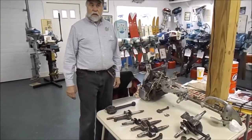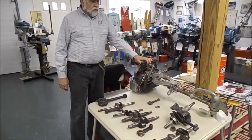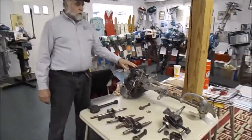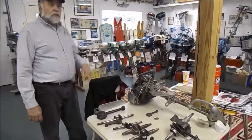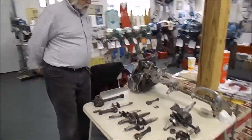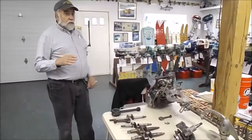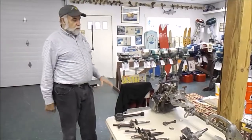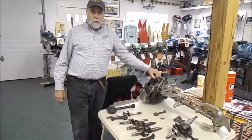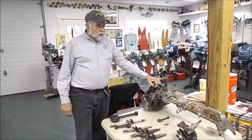The ELTO was an early example of an outboard with a case hardened crankshaft. The Johnson breakthrough really came with the Johnson motor wheel and the hardened crankshaft, still with a bronze rod. Now we're in the 20s, speeds are going up and up — early 20s maybe 2400 RPM, while ELTO was still at 1300 or 1400 RPM.